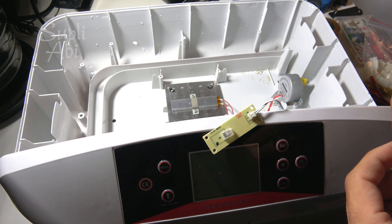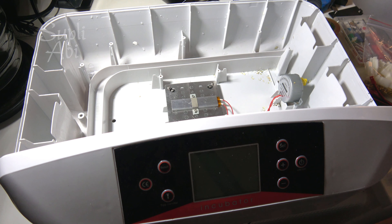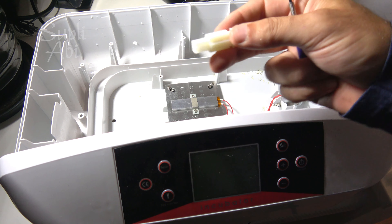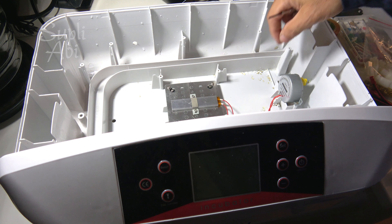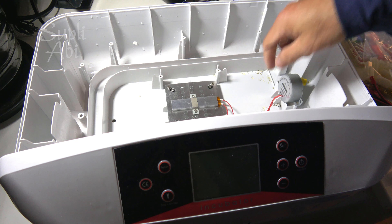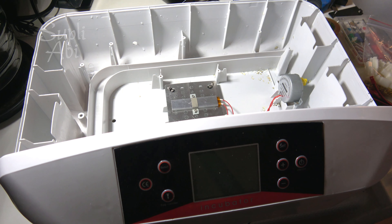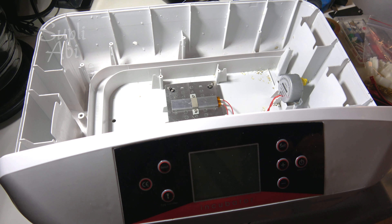I will take off this connection with the solder, then I can connect and disconnect easily. For the motor and heater I have to cut the wire and then put this connector on them too. Actually, for the motor it's not important which terminal you put plus or minus, but after you have to check — when the switch cuts, cutting the positive side is better for safety.